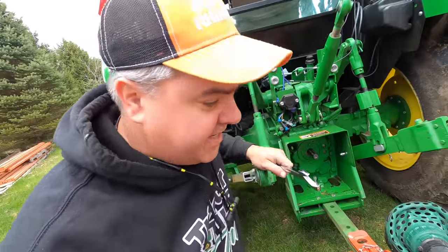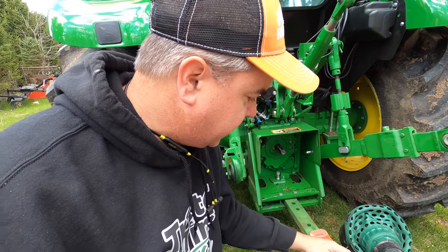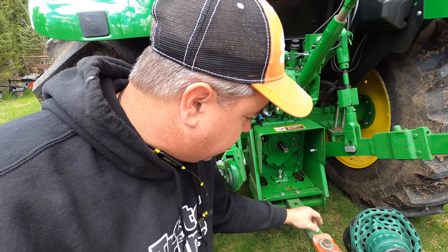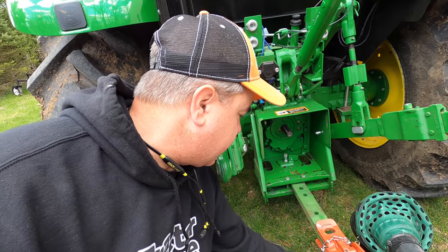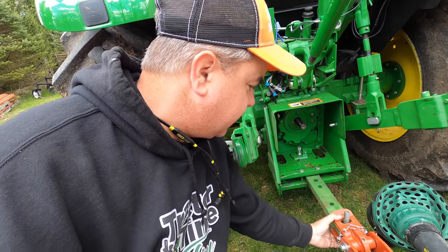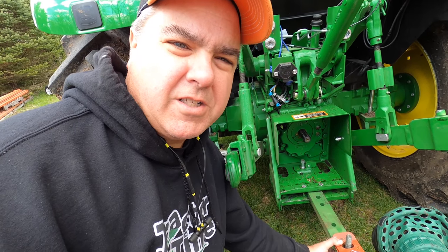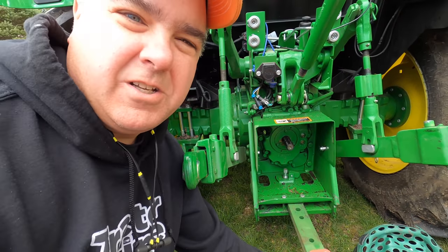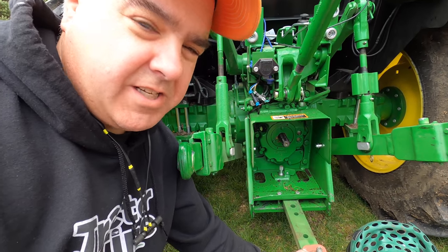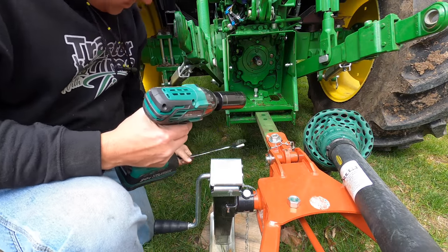Now on this TS10, and quite frankly, most any pull type attachment, you really shouldn't use a regular hitch pin. You need to use a bolt. Now, my family always inserts the bolt upside down. I'm not sure why. Seems to make sense to put the bolt in from the top, and then if the nuts fall off, well, the bolt still might hold. But you know what, if your family always does it that way, well, maybe I should too. Kind of getting lazy in my old age.